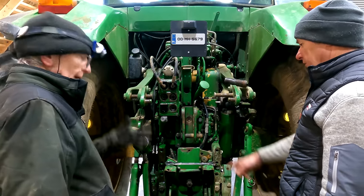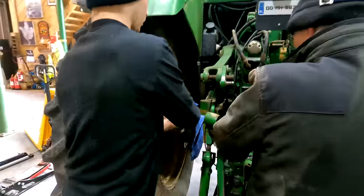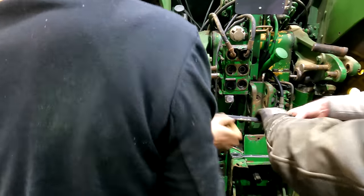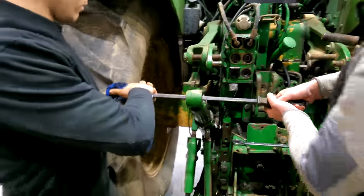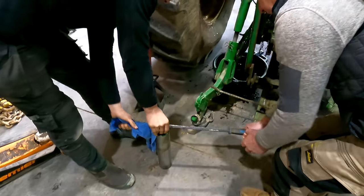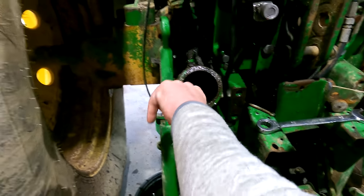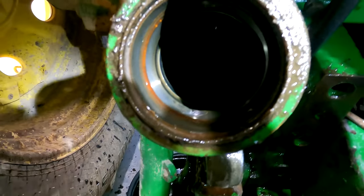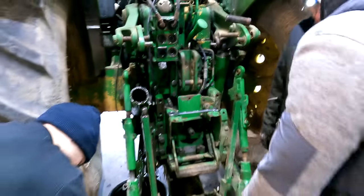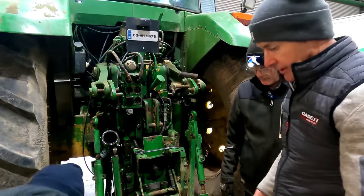Do you want to lift it out? There we go - that makes life easy. We might as well throw them in, piston out. That one was wet - set the seals in there. That's something that was a bit damp around before we started. This one's fairly dry, but we've gone this far, we might as well do the same here.